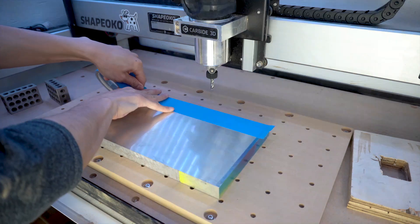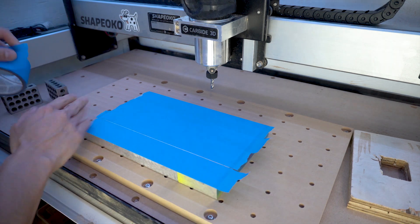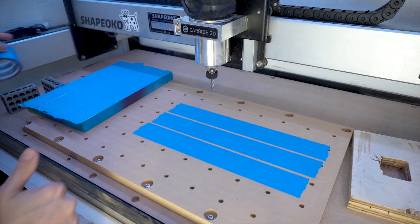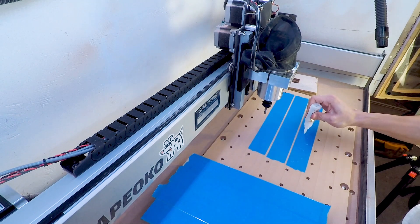In order to ensure that both sides are machined symmetrically, I milled stock and drilled indexing holes aligned with the threaded insert spacing on the wasteboard. I modeled the dimensions to have significant margin around the heart, mainly because I don't know what I'm doing and it seemed like the right thing to do.